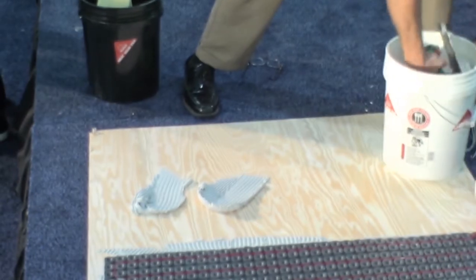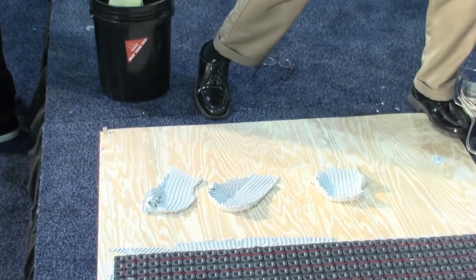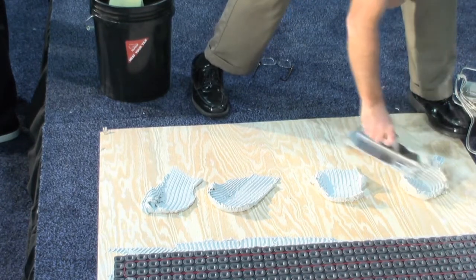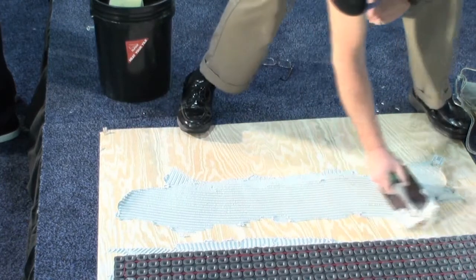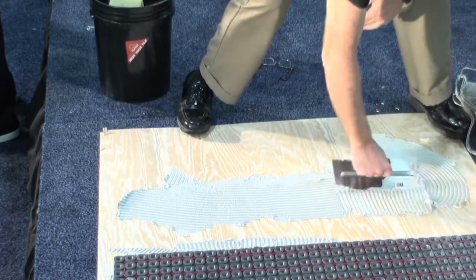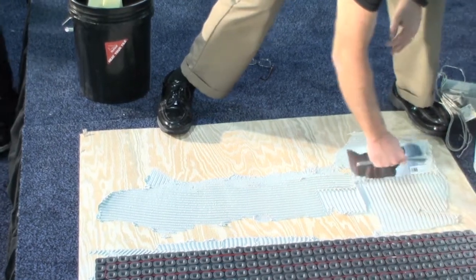Sometimes they'll have a rule where they say you can't go over 85 degrees. On our thermostats, you can say, is this tile or is it laminate? If you say it's laminate, then the thermostat will never go over 82 degrees. So it'll keep you from ruining your own floor, pretty much. Thank you for the question.